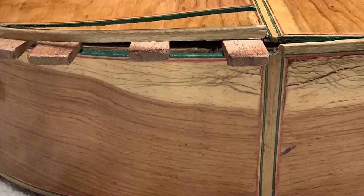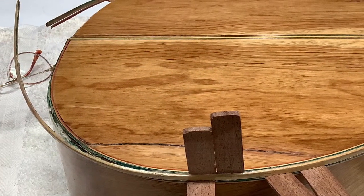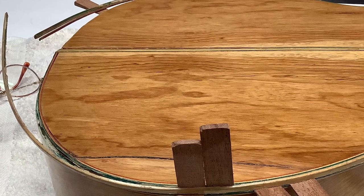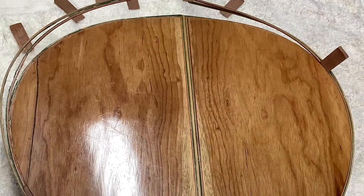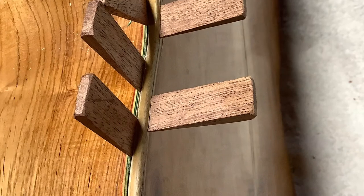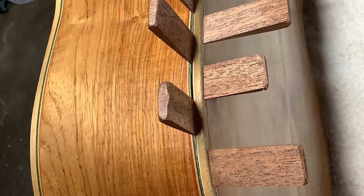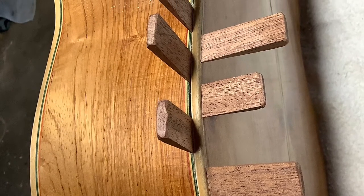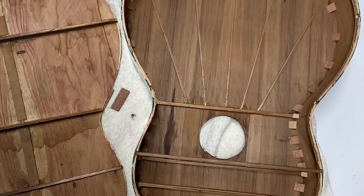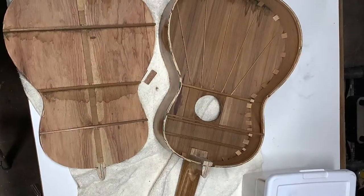What we're attempting to do here, step by step, little by little, is to remove the edging which holds the back in place, and then remove the entire back. This crack has been filled partially with adhesive and we need to take it totally apart, remove the adhesive, and put it back together nice and tight. You really have to give yourself a lot of time — this took, I think, five hours just to remove the edging and to open up the back.